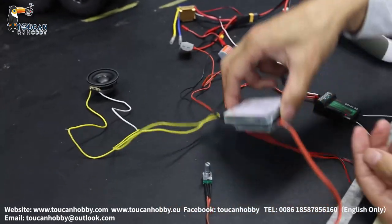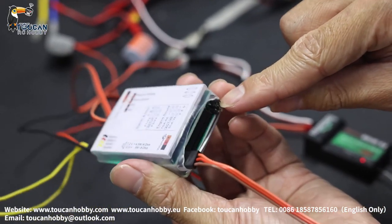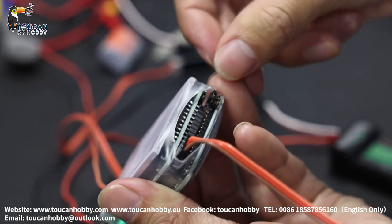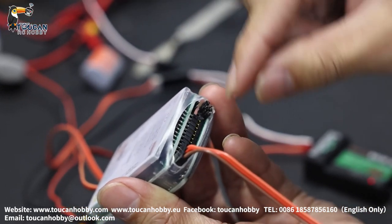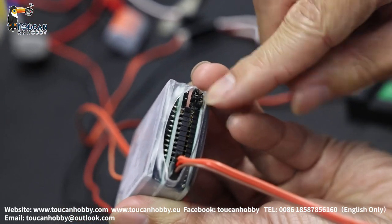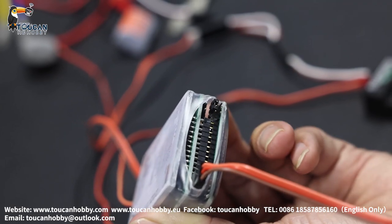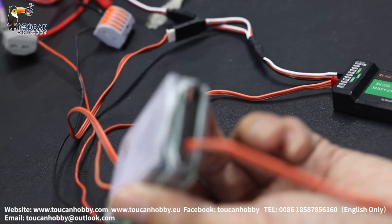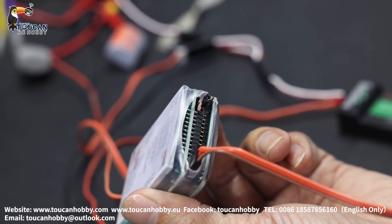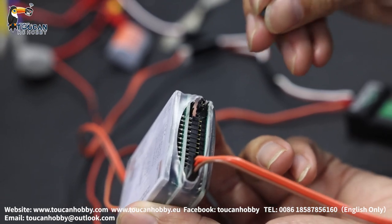Let's see the board. It has three engine sound effects. There is a menu here — the upper line three-pin connector is for changing the start and horn sound, but actually you cannot change it. Don't take out the short plug on top — leave it, don't change it. The downside three-pin connector: if you take out the plug, it will be a different engine sound. Without the plug it is V4 or V6 sound — that's the V6 sound. If you plug it to the right side, it will be an R6 sound — now it is another engine sound.